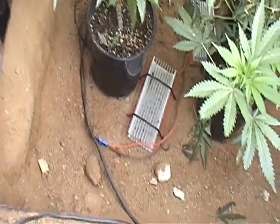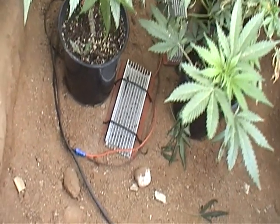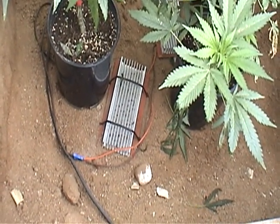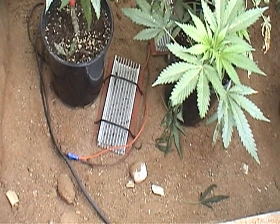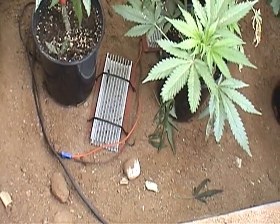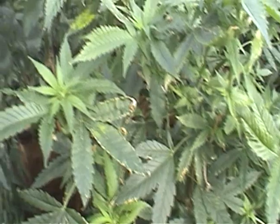I have a little heater that I built. This is one section of it — there are two little identical plates like that — made with television parts and medical equipment parts. I have a little heater blanket on each one of those heat sinks, tied and wrapped together with about 30 volts at 3 amps that I supply through the transformer.